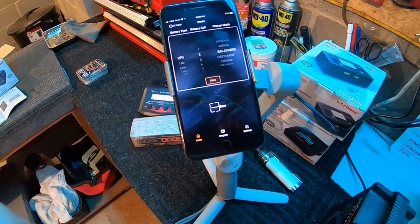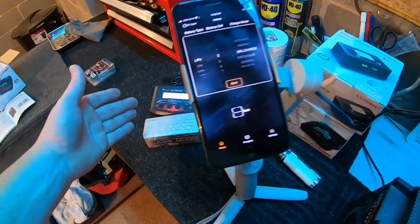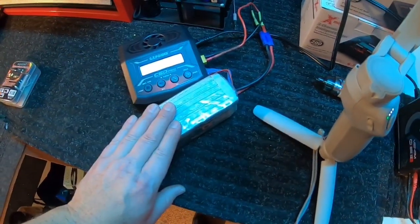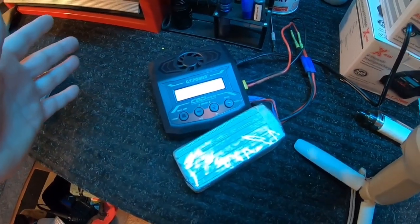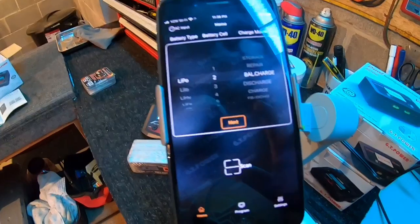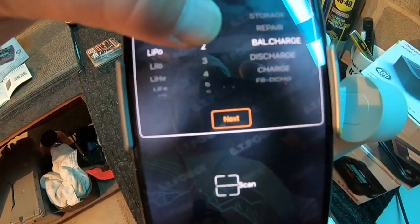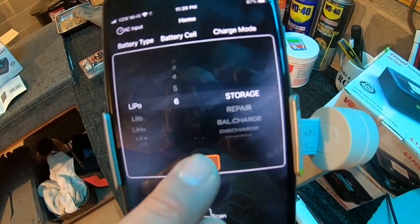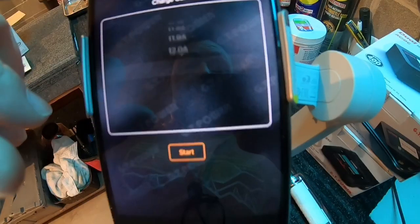The audio sounds a little different because I'm on my GoPro so I can use my phone to show you the app. Very easy — I turned the Bluetooth on my phone and it linked right up and asked to connect with the GT charger. I plugged in another 6S lipo since the other one charged up quickly with a nice loud audible beep. Here in the app you can select your battery type — LiPo, whatever you need — so we're going to do a LiPo, 6S, and storage mode. Then select your charge rate — up to 12 amps — we'll go with 2 amps.